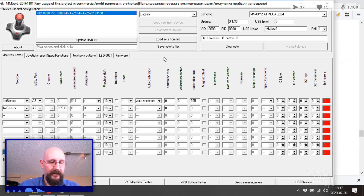Now we're going to need to set up our matrix for the buttons. So let's start with the... Well, let's get this button matrix plugged in. So, gray and white, what were you for? Green and gray is lower thumb, and white is pinky. So we'll get those in the end, I think. We're going to start with green, which is going to be our ground. Actually, you know what? I'm going to plug that into the ground strip up here.